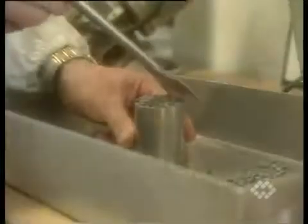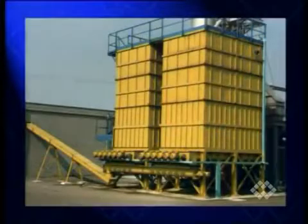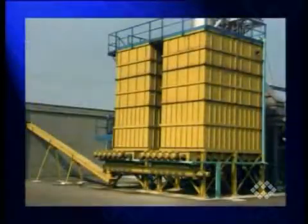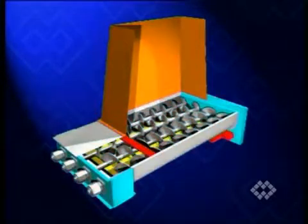Certain bulk materials cannot be stored in cylindrical silos with an outlet cone because no flow aid would extract them. For some of those materials, the outlet cross-section of the silo must be increased. Others don't even allow the slightest wall angle in the outlet section and require rectangular-shaped silos with vertical or even negatively inclined walls all the way down to the outlet. As a result, mechanical feeding devices must be adapted to the cross-section of the outlet.